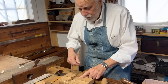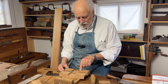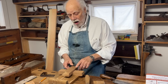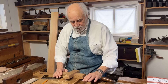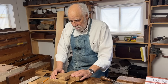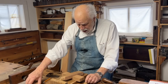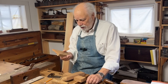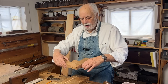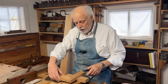In doing all of this, the thing that guarantees success is the fact that I took the trouble to mark how the pieces go — G, B — so I know they will fit perfectly. Now if you want to try that I'd suggest you do, but I'm going to give you a little challenge: after you've done this, take another piece of wood and make a mitered half lap joint so that it goes together like this. Sometimes when making frames or drawer containers this looks a whole lot nicer.